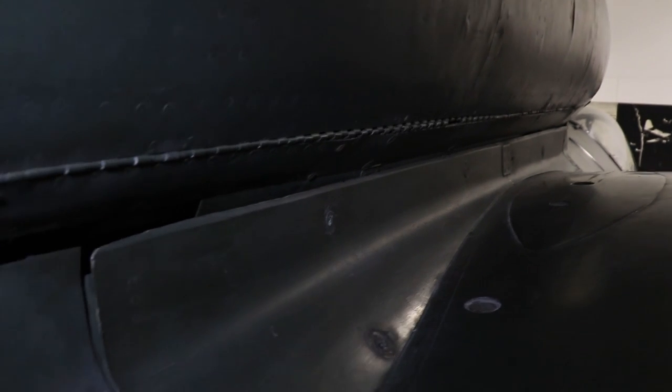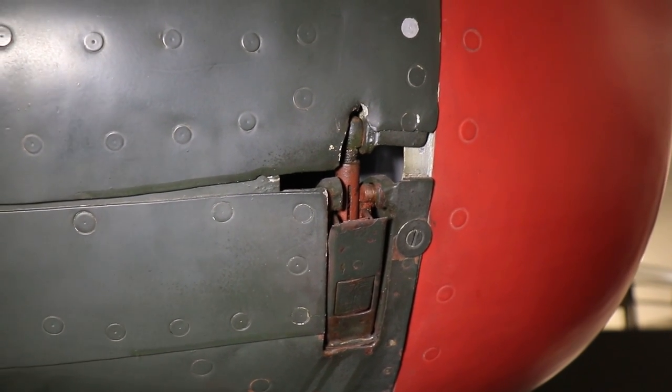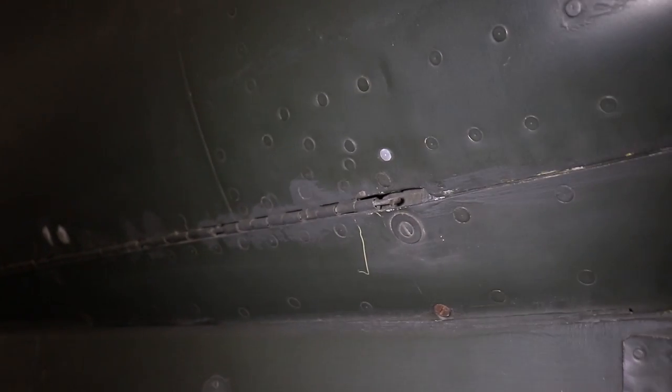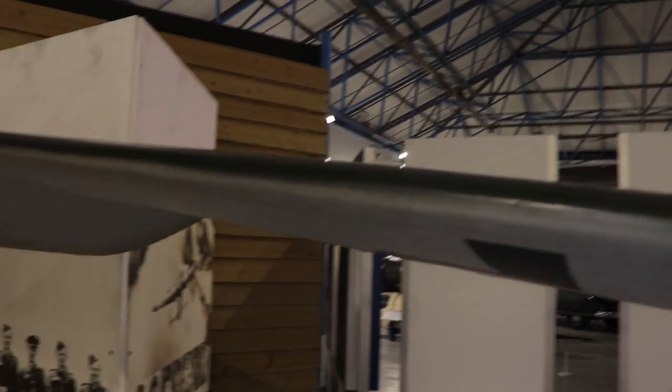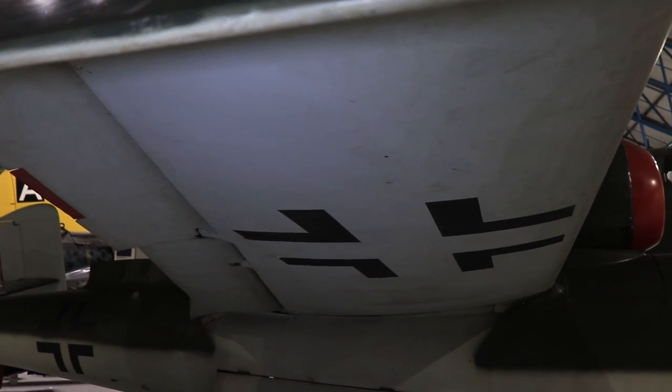If you look at the installation of the engine, you will notice how simple it is. The covers can be quickly opened up with quick release latches on top and completely dismantled with latches on the bottom and hinge pins running along the side — the same can be said about all of the top fuselage covers. Moving to the wing: the wooden wings extend out of the upper part of the fuselage in what is known as a shoulder wing configuration. As a dihedral wing, it extends upwards. At the wing root we have a little airflow fence, and a drooped wing tip was added to counter stability problems — this one is made out of duralumin.